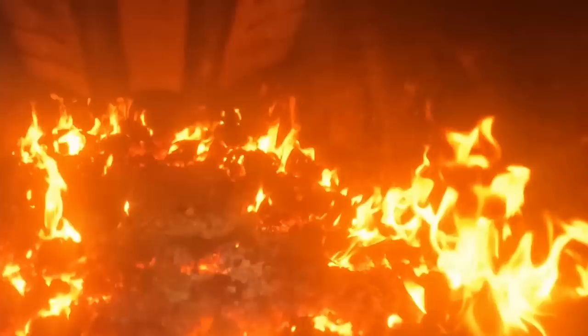You can see that there is fresh coal scattered about the box that was the last coal that was added in before we stopped. You can see the biggest flames in the back right, and all the way up at the front by the tube sheet and where the arch brick is, there's a fair amount of fire as the fire bed's the deepest there, but all across the middle and the middle left is all dead. And so that's the stuff that we need to fix before the train departs the station.